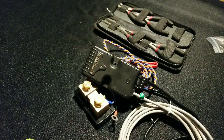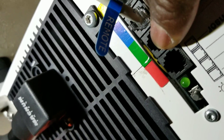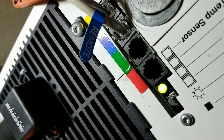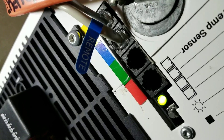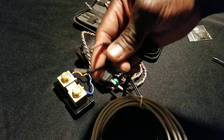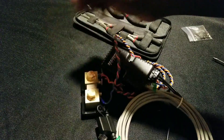I'll take you to the inverter so you can see exactly where this plugs in. The remote is the blue one — it says 'remote' — so the remote plugs on the blue side. The green side here is the network, so the device that goes to the BMK plugs right there — it's almost like a telephone jack. When it plugs there, that completes the installation. Hook up the power — the positive and negative on the other side — and take those two terminals and hook them up to your bus bar or battery terminals.